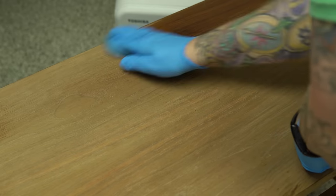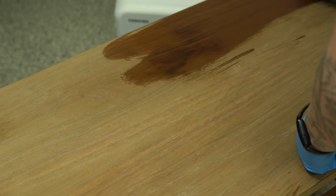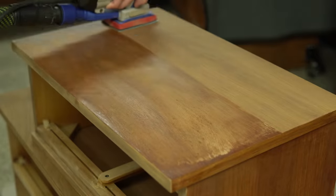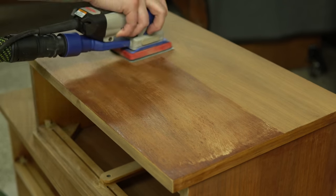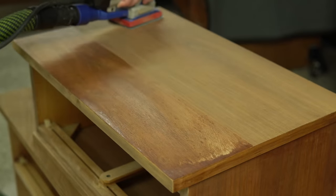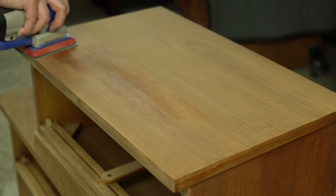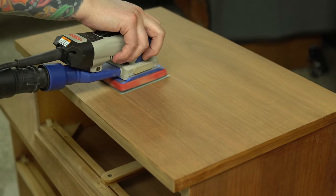This is what our stain looked like after 1 coat of oxalic acid, so I added a second coat, and then a few hours later, a third coat. Like I said before, there's no point really sticking with it after 3 coats because it's just not gonna work. And in this case, after the third coat had dried and was rinsed and dried again, the stain was still there.